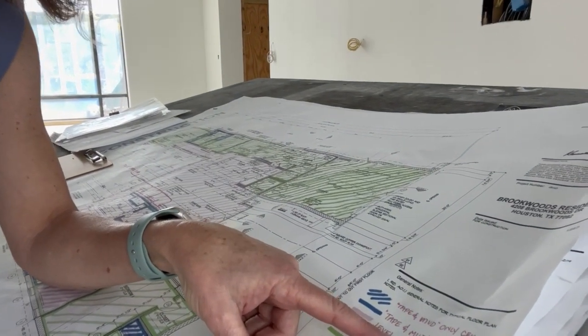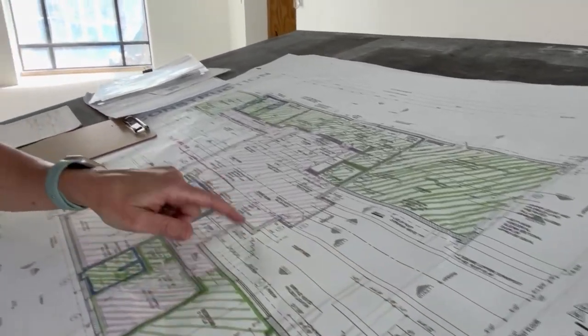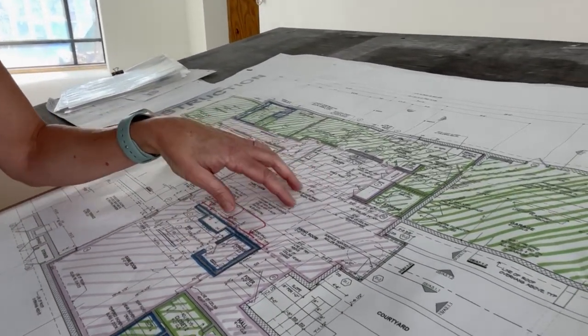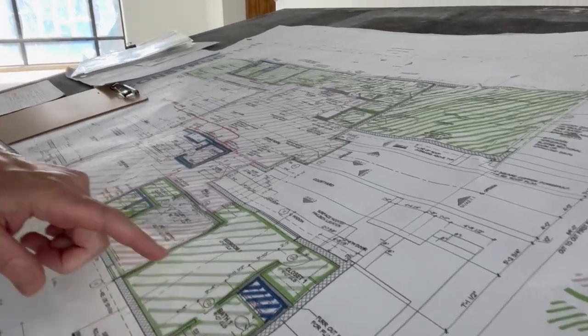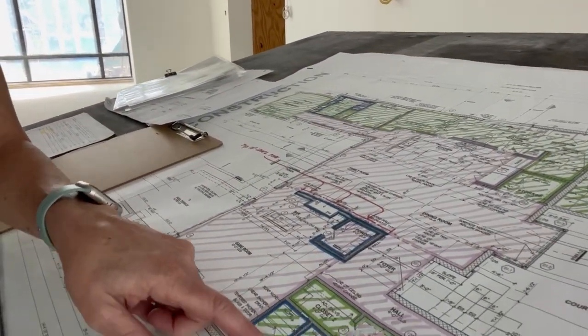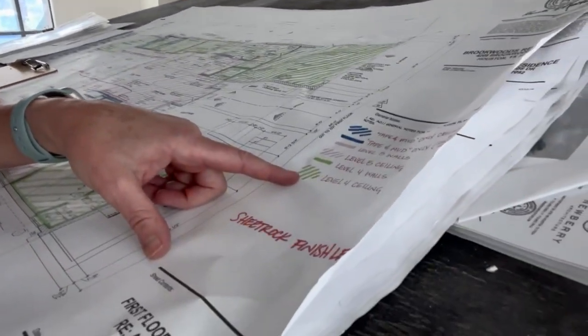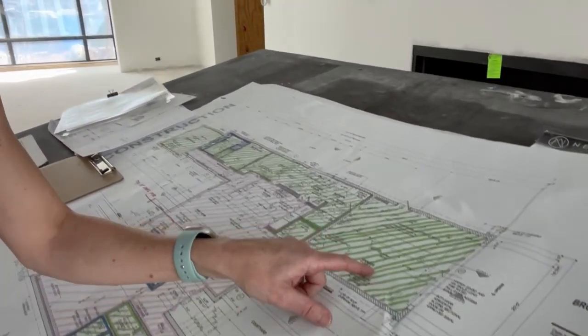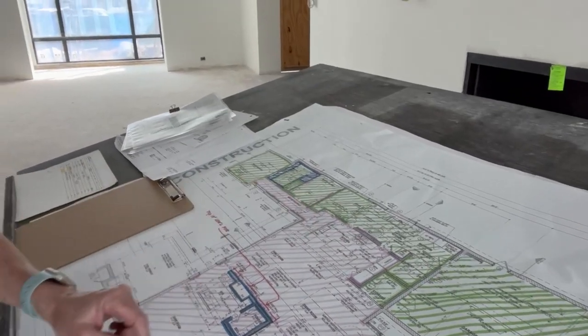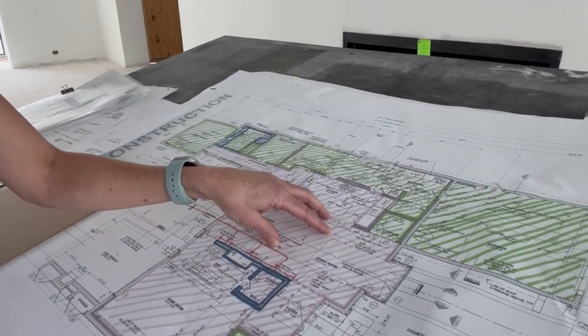Level five walls right here — that's in purple. We're going to spend the money on the level five. In the blue areas, we only need tape and drywall, because those areas will have some sort of stone on the wall, so we really don't want to spend money on taping and floating there. You can see the green here — it's kind of hard to see — but that's level four finish, walls and ceilings. So level four is green, level five is purple, and that way we have the house broken into sections and we're going to spend the money on the level five.